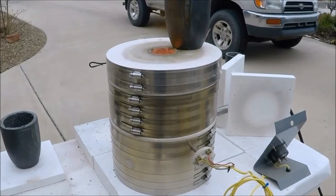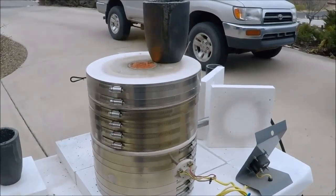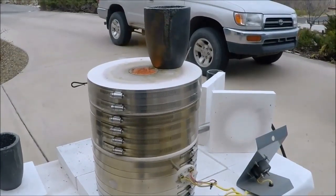That crucible is sitting off to the side of the hole, but the flame is still hitting it on the edge, so it's still going to get plenty hot. It helps as far as thermal shock to go ahead and warm your crucible up. But you want your material inside your crucible, because if you stick the bottom of that crucible over that hole, the bottom of that crucible is going to get hot. And unless you've already got stuff in there, you're going to have a hot spot in the bottom of that crucible.